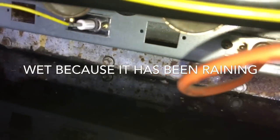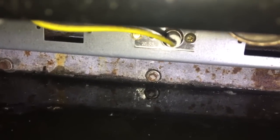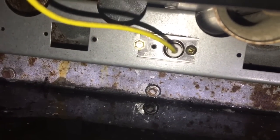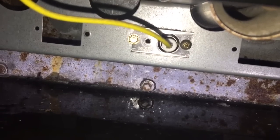You'll need a Phillips screwdriver and a quarter-inch nut driver to get that out of there. Let me see if I can get the camera under there. Loosen up that Phillips, then take out that quarter-inch nut, and you can pull the flame sensor right out of there so we can clean it.